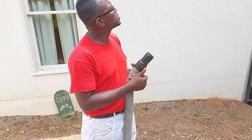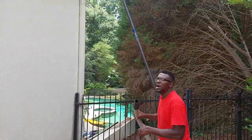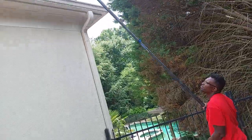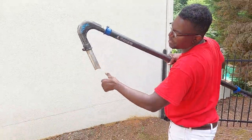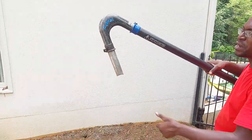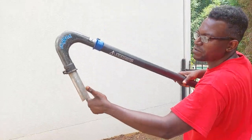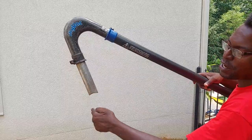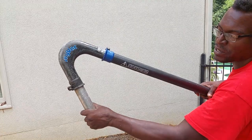As I'm vacuuming up here, I'm going to be tapping my gooseneck. This is my favorite gooseneck attachment because it has this little space right here. So I'm in the gutter, gliding left and right, and what I'm doing is tapping whatever's in the gutter and allowing the suction to happen on its own. I don't want to stuff leaves and debris into my gooseneck - I want it to naturally go right up there.